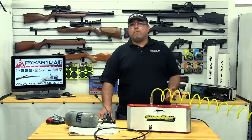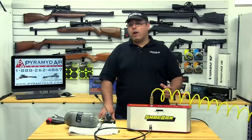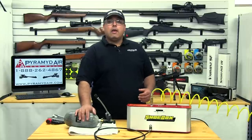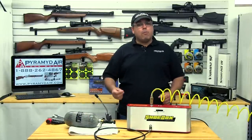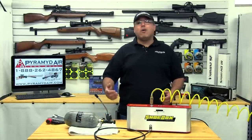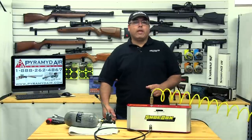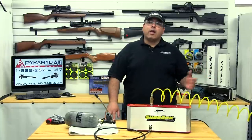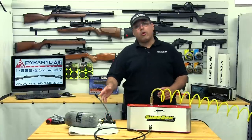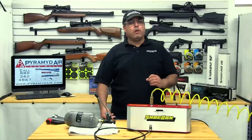There are a few things you're going to want to look out for. Because the Freedom 8 fills in very, very small amounts, any leakage is going to mean that you'll never fill your bottles or air gun. When I first received my Freedom 8, I couldn't get my 4500 psi bottle to reach full pressure. At the advice of their support techs, I got out some soapy water and carefully checked my hoses — and sure enough, I found that my hoses leaked. I replaced them and everything's been good to go since then. You're also going to want to get some sort of moisture and particle filter. The air from your standard shop compressor could be full of contaminants, and the last thing you want is to be dumping those into your expensive PCP air gun or your tank. Make sure your system is equipped with a filter before you start filling.